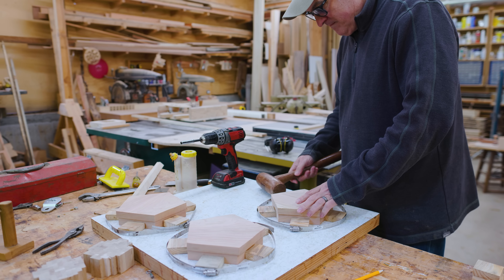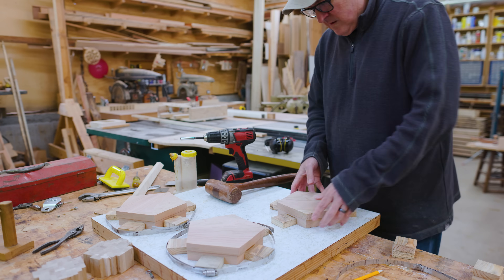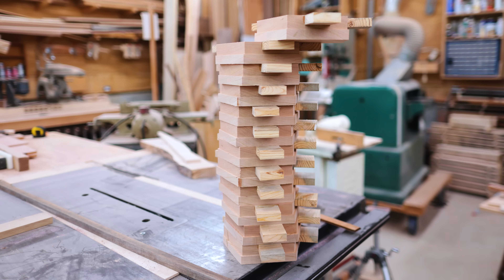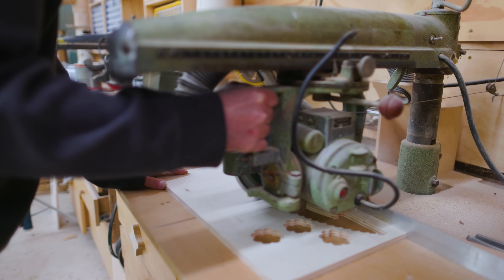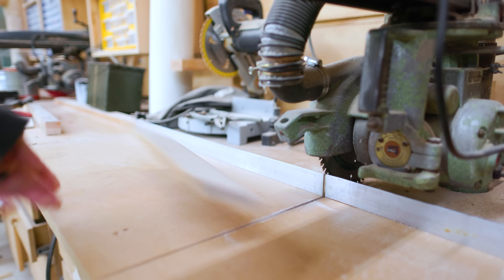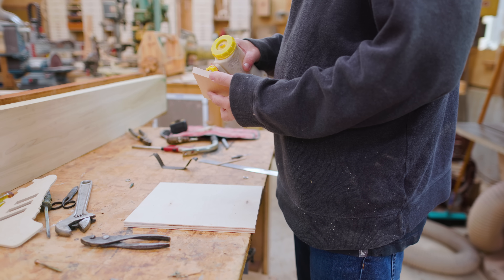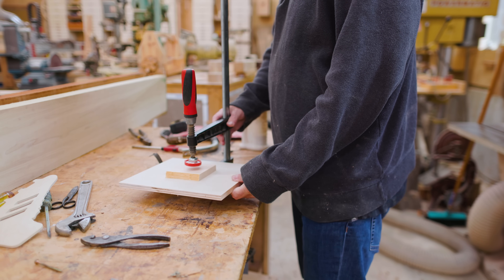Having a direction means I would be able to orient the pentagons back onto the jig in the same way. I made 14 pentagons just so I'd have some extra, though I didn't end up needing them. I need to make the tenon part of the jig, so I found a little scrap piece of hardwood that I made a square out of, and I glued that to a piece of half-inch plywood. This will become the jig for the project — really the most important part.